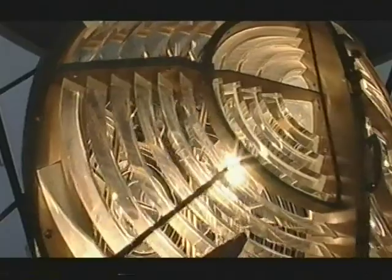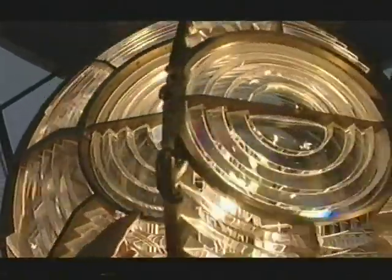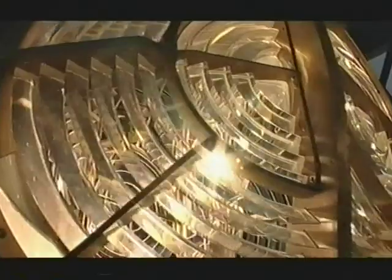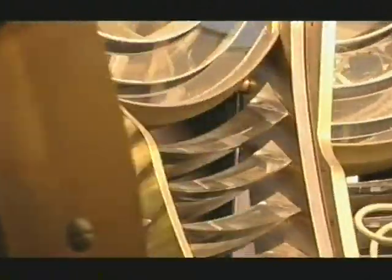3 have just gone past, and here come 3 more. There, and one more. Right. Now, it doesn't matter at all that 4 out of the 6 bullseyes are half size. That makes no difference to the effect of the beam or the brightness of it. The middle bit of each bullseye is a very powerful magnifying glass, surrounded by rings of refractive prisms. And the combination of that magnifying glass and those prisms produces a parallel beam of light. We've got 6 bullseyes, we have produced 6 beams.